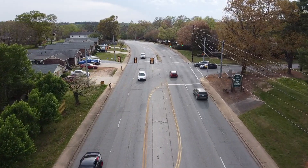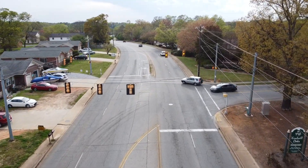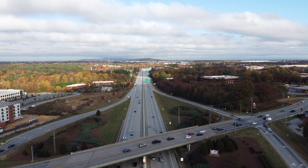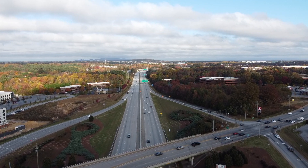The higher the resistance, the harder it is for the current to go forward. Think of current and resistance like cars going down the road. The cars represent current, and stoplights represent resistance. The more stoplights you have, the harder it is to move freely down the street. But on a highway with no stoplights, the current — represented by the cars — is moving just fine. And our third term is voltage. At its most basic definition, it's just the amount of pressure or force it takes to push the current down the wire.